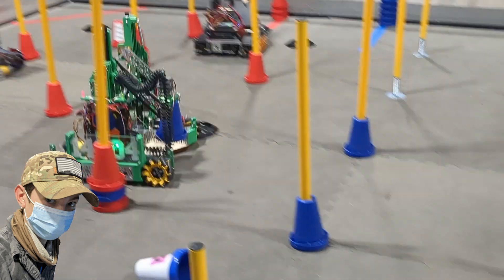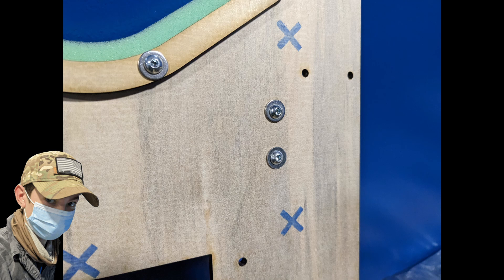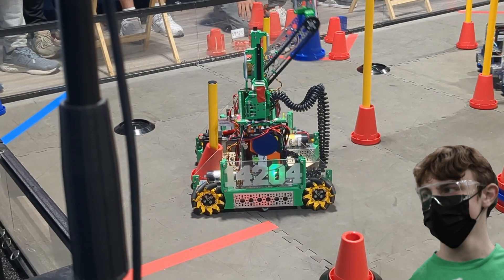We also had issues with knocking over cones. To fix this, we were going to add a dampening material on the cone center to grab the lip of the cone as it falls. We also ran into problems with getting caught on the ground junctions — the screw heads that attach the cone center to the chassis would often get caught. We're going to fix this by switching to button head screws and making the center thinner.